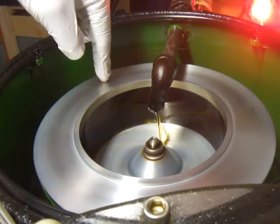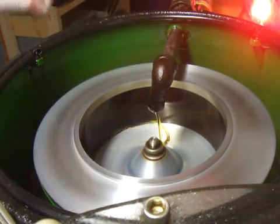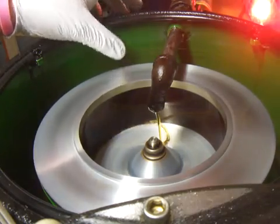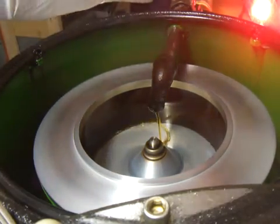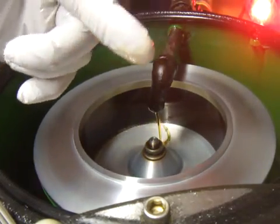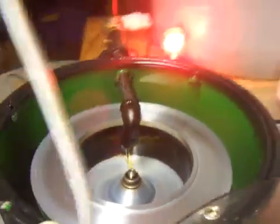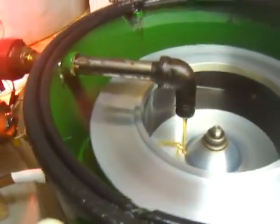If you touch right here, you'll be able to see the oil spray up — and that's where all the clean oil is. You can see clean oil coming out on this side. And that is how the centrifuge works. Thank you.